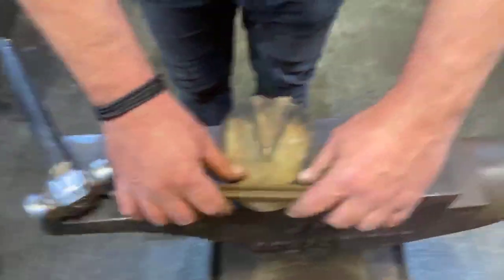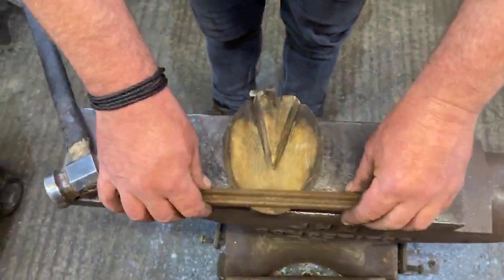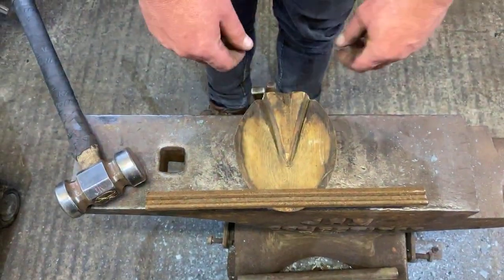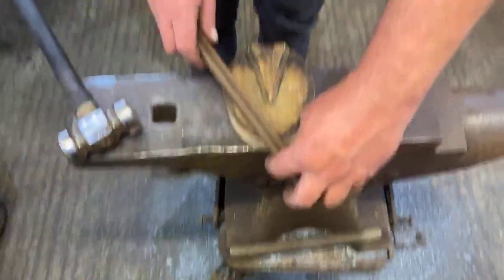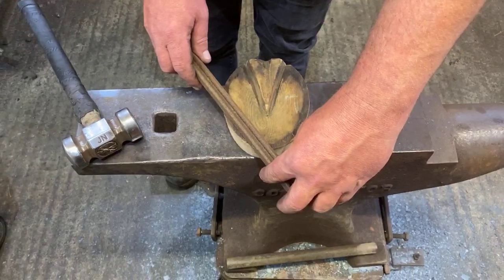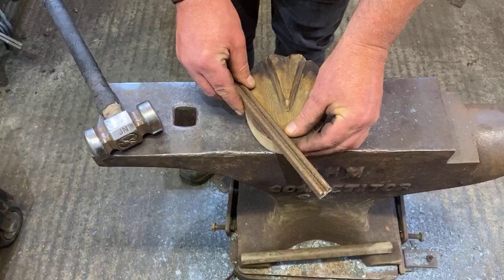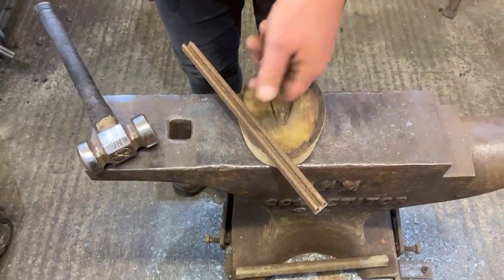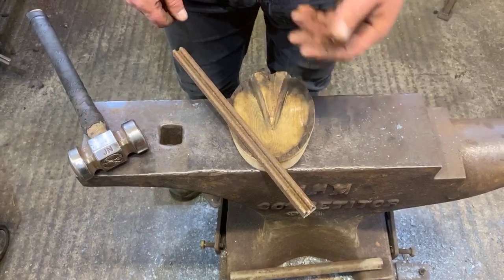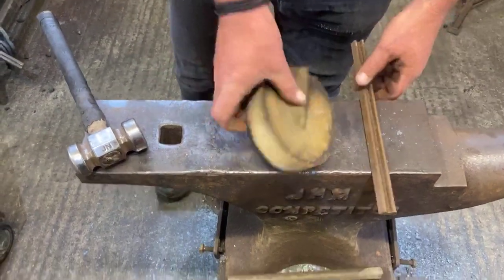Okay, so for example, our normal toe bend, we'd have our normal balanced toe bend following that foot shape around, albeit a little bit underneath. Okay, however, this shoe we're going to want to come pretty much straight, a lot straighter between the center of the toe to the quarter. Okay, and then we're going to follow the radius around, albeit with an extreme brushing edge on it. Okay, so that's really important.